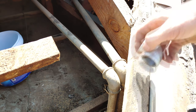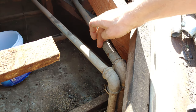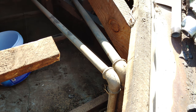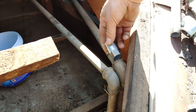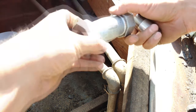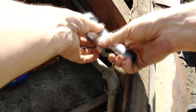Here is a new elbow just so you can see what it looks like. This pipe looks fine, so I'm just going to fix this section. Ideally it's always good to try and replace as much as you can, but in this case I'm just replacing the section. The method is to cut with an angle grinder, then put in a new section and join it with a Johnson coupling. The Johnson tightens on either side onto the pipe and makes a watertight seal.